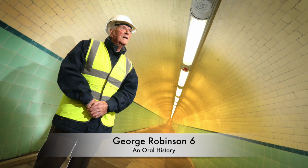It was all dynamite, with two tails hanging out of each one, maybe four or five holes, a foot deep or whatever. The dynamite was inserted like a sausage with two wires hanging out. You used to stem them up, the miners, with a brush shank, and then pack a bit of clay or whatever they had in to stop the thing from coming out.